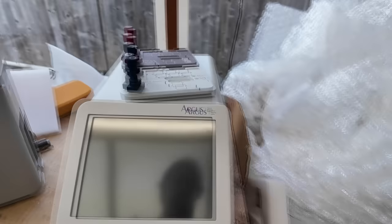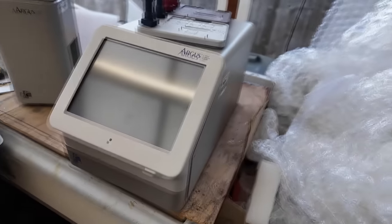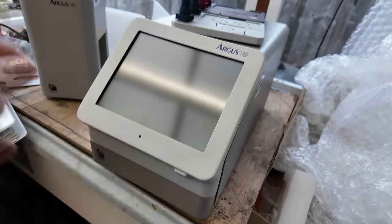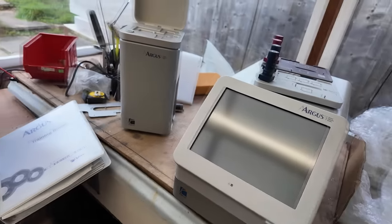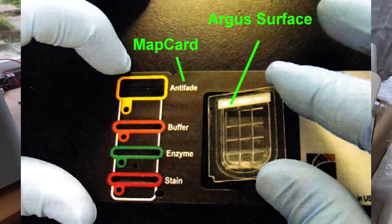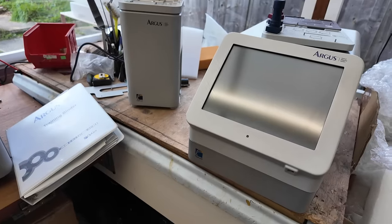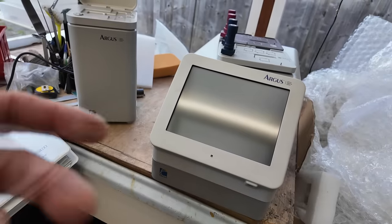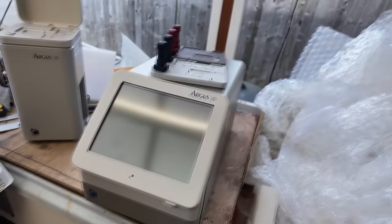There's also this unit here. I was a bit puzzled as to what this was originally because it just appeared to be a screen. But there's actually a drawer underneath which comes out, and I've got some pictures from the training manual I'll insert. It's a carrier that actually puts the fluids in — there's a slide with channels where the actual reactions take place. This has various pneumatics to squirt reagents through the slide, and there's a Peltier unit to control the temperature and probably do thermal cycling.